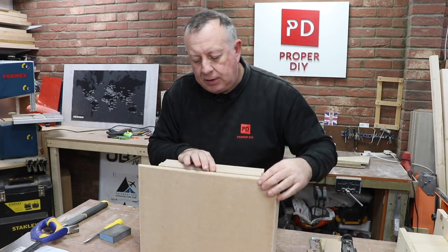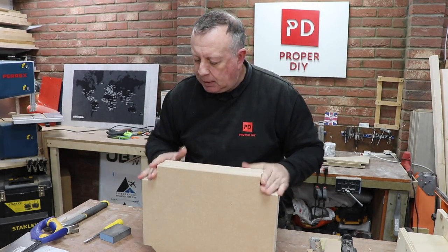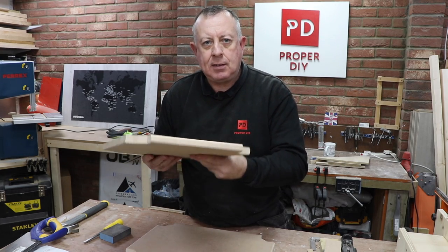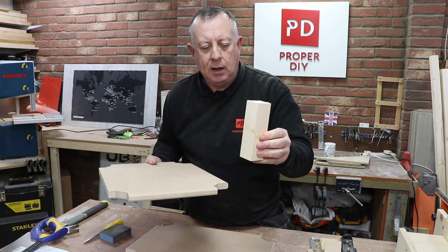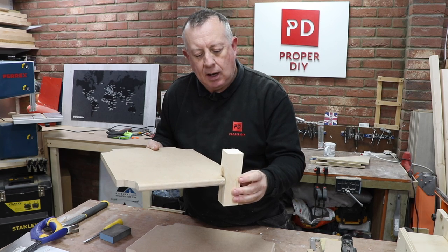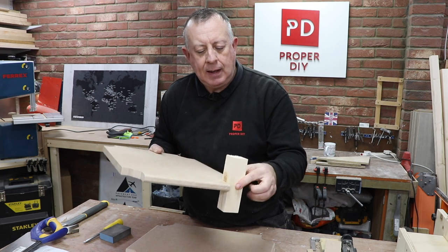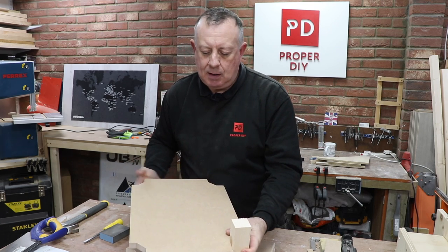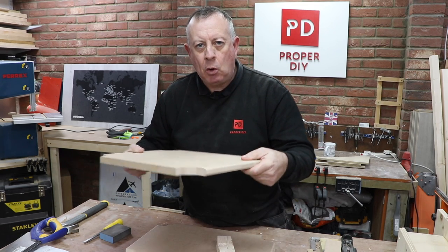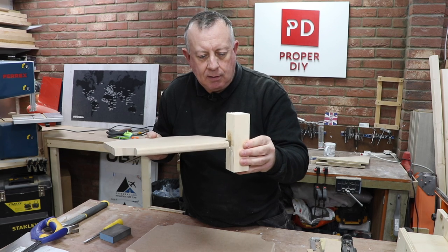So that's all the shelves cut and notched out and the top one is just going to be a plain oblong shelf that sits on the top. The other ones you'd have seen me cut these strange shapes in the corner. The way this is going to connect to the upright in each corner is to do a notch in the upright, and that fits into this strange shape that I've just cut, supporting each shelf one in each corner. The only thing going on these shelves are towels and lightweight stuff so load wise I don't see that as a problem. I'm a little bit more worried about the shelves racking and moving around, so this notch has to be nice and tight.